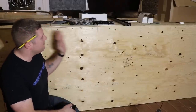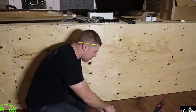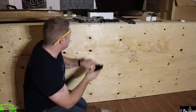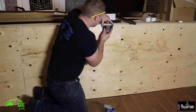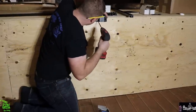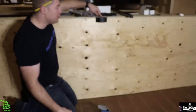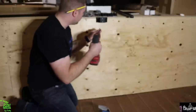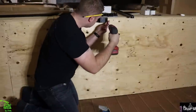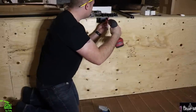So let's build the EXT bracket. I took it and I divided it so I have all my centers marked. I'm going to place all five. This is how I got it all marked out. We're just going to grab some screws and a drill, and we're going to put our bracket center just like that and screw it right on. Just really driving them in — it takes four screws.